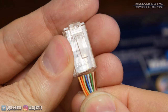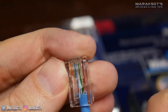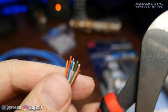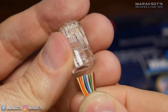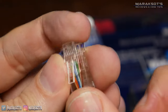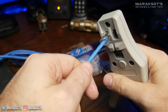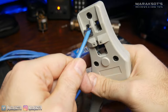This next part is probably the trickiest part of this whole process, and that is keeping the wires in their proper order as you insert them into the connector. You first have to press everybody nice and close together and keep them all in order. At this point, if your wires are all uneven, you're going to want to trim them off just a little bit and get everyone nice and flush with one another. You can then insert the wires into the connector with the clasp pointing up, making sure all the wires stay in their proper order and also go all the way to the end of the connector. All that's left to do now is insert our connector into the RJ45 slot on the crimping tool, crimp it down, and that's that.